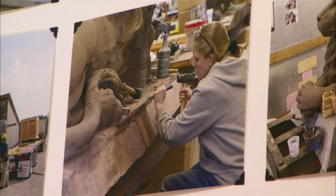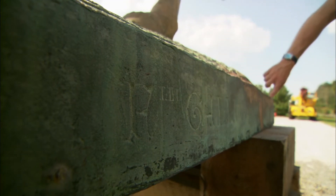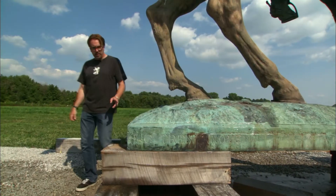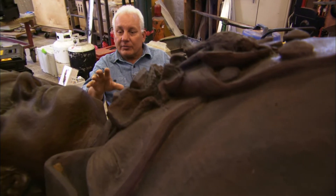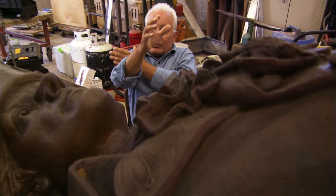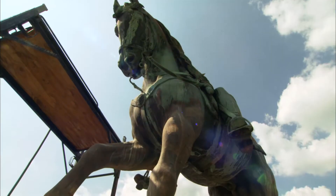Typically, the work was done in a secretive manner. So this is the foundry mark with the location, the name of the foundry and the date. And on this side, you will see the signature of the sculptor. These were cast in large pieces — this man was cast in one piece except for his arm from about here out, but the rest was all cast in one big casting. And the same thing with the horse — it was cast almost complete in itself.